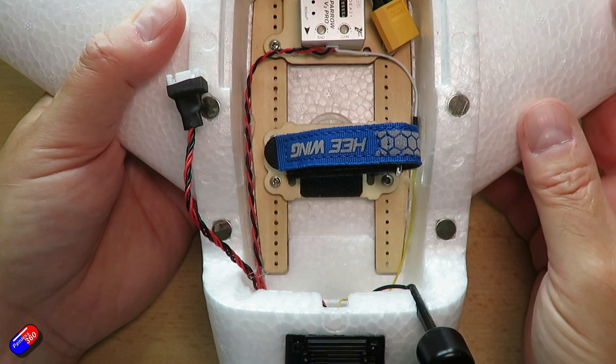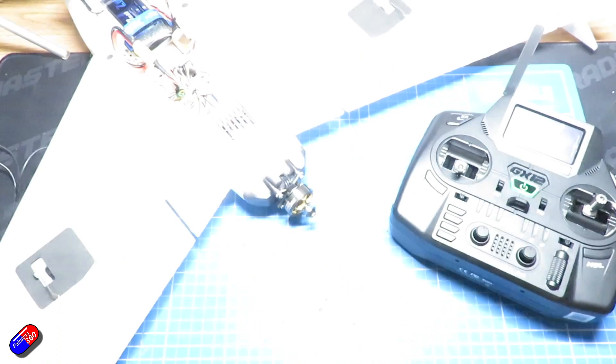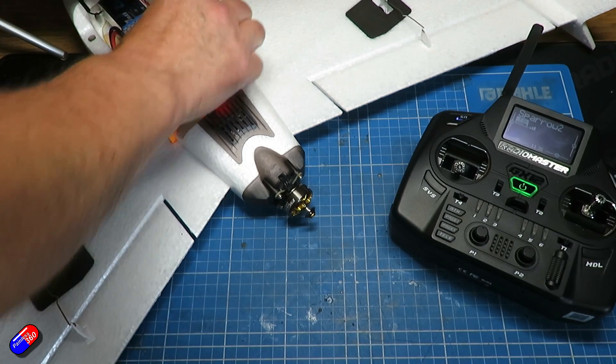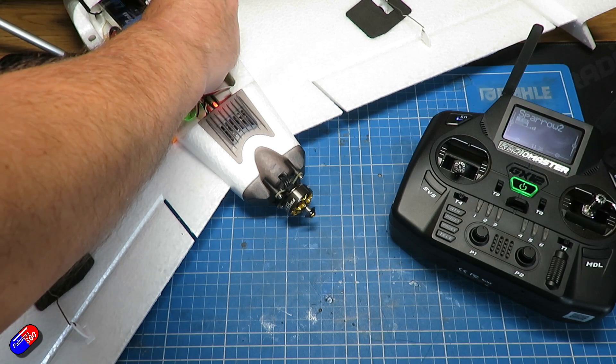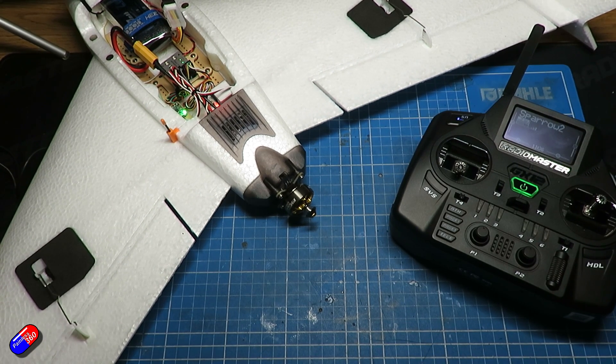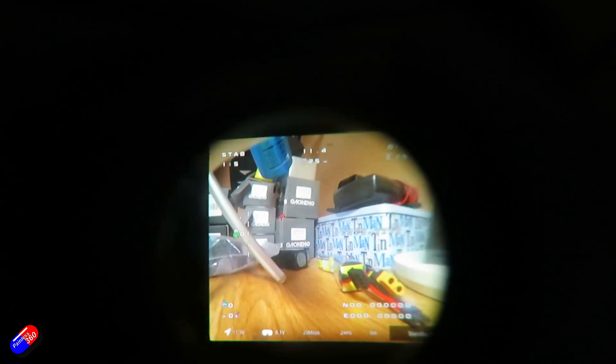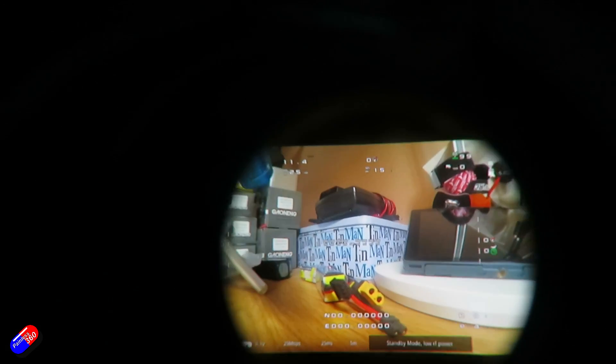Now that's all together, we can plug it in and see if we get anything on the screen. Here on the bench — I'm narrating this bit because it's very loud — the goggles are starting up. I have a fan running on the avatar system so that it's not going to get hot on the bench. I'm connecting the power to the avatar system, which is also going to send the voltage into the port so it can be measured. We're waiting to see whether it actually appears in the goggles with both an image and crucially an on-screen display. And very excitingly, I've obviously wired it up correctly, because not only do you have an image out of the model but there is an on-screen display overlaid as well, which is fantastic.